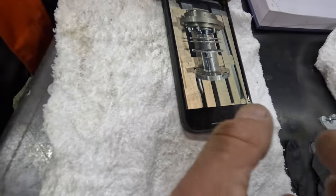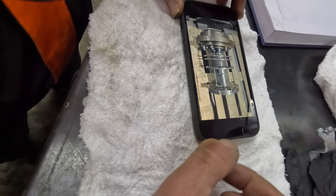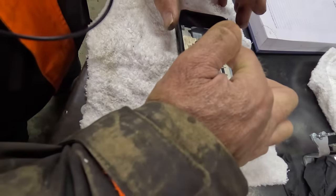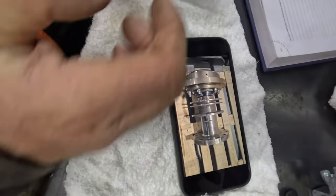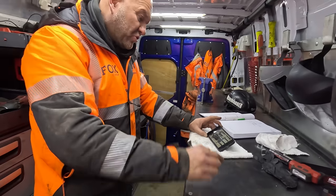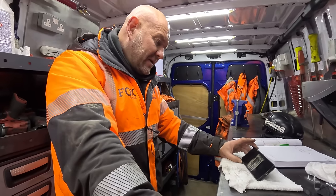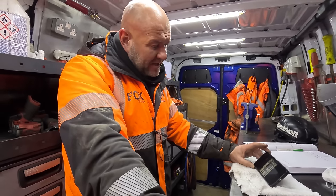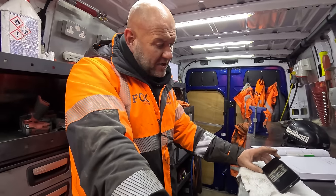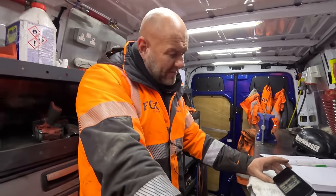Get hold of the shaft. Like I said, we'll put a beam down and put a beam there and get a chain block around it. Take the weight, unbolt it here where it bolts to the frame of the machine, and then pull that whole thing out. But that weighs 250 kilos, just that alone. So that's telling me we're probably going to need a telehandler, or if I can't get an excavator to reach it, I'll have to get a telehandler up to lift it up there, because it's just too heavy to manhandle up there.